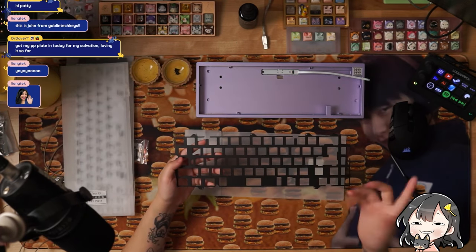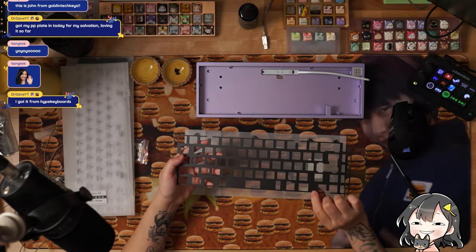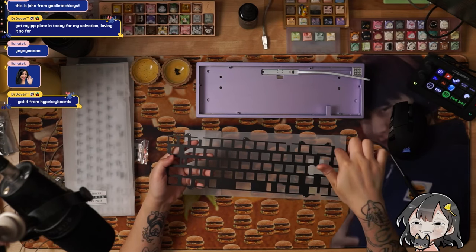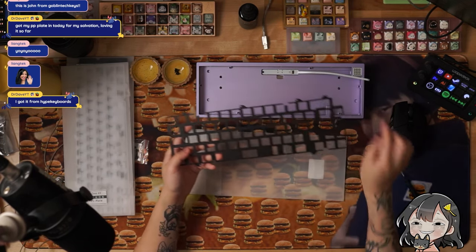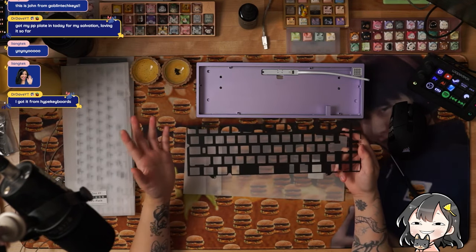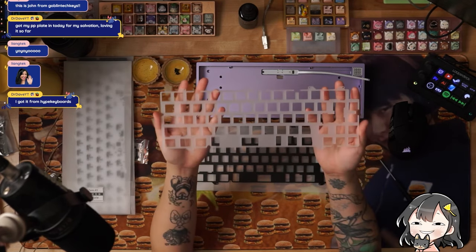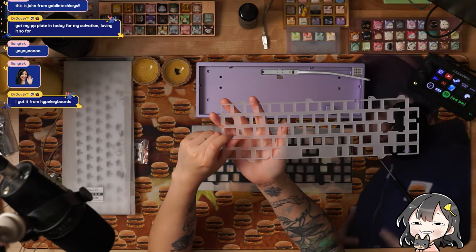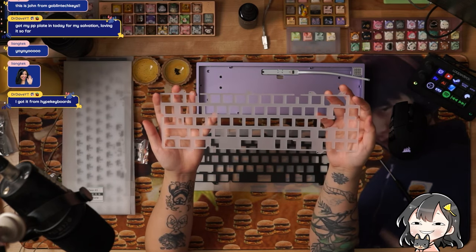The cuts on the case appear to be for the PCB gasket and not the top mount. Looking at the aluminum plate, here are your six top mount points — four on top, two on bottom. There is no mounting point on the space bar, but there is one by the arrow blocker. The plate already has the blocker cut off so you won't accidentally put a switch there. The cutouts on the plate are for the case screws. There are no flex cuts, but there are relief-style design cuts so the plate doesn't contact the case screws. The PC plate follows the same layout.